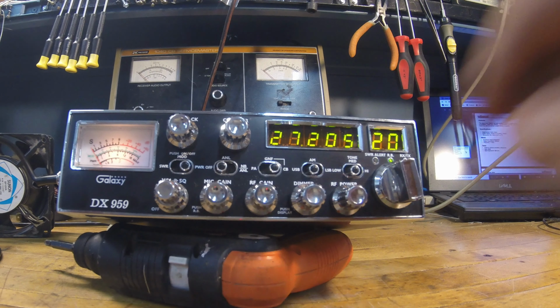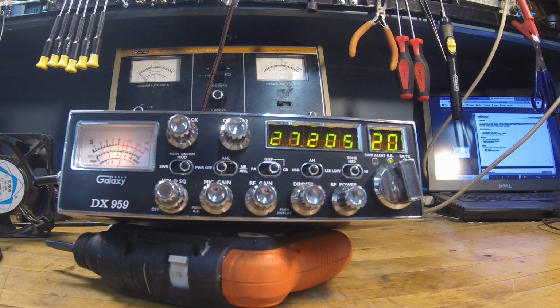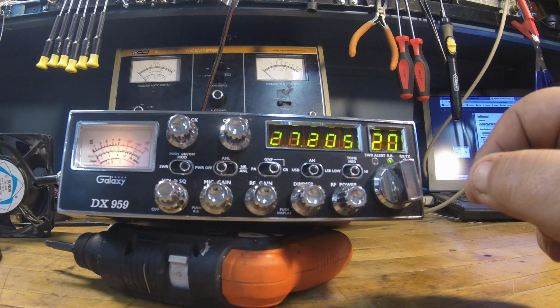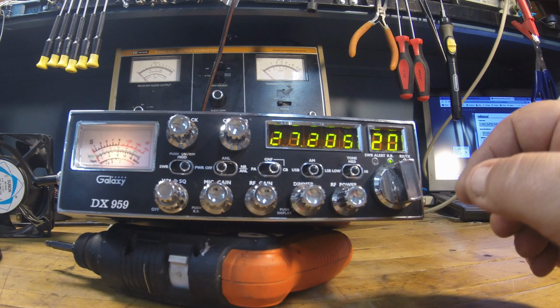And max low power. Hello. Yeah, that's some swing there. It's annihilating that 10 watt scale. Hello. About 12 watts on my PDC up here, but the BK showing 10 to 12. That's low power. That's about a watt and three quarters to about 10 to 11.